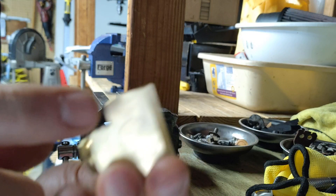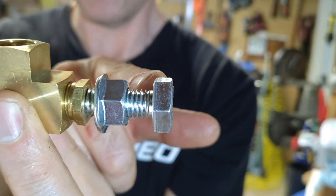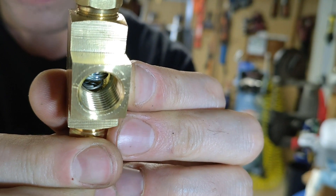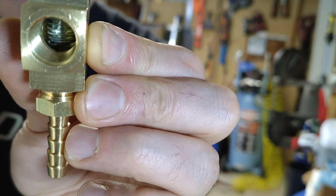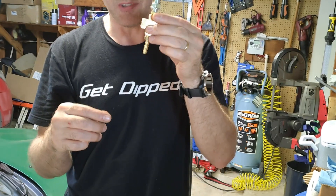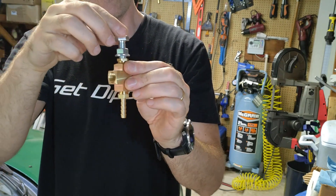That's pretty good. Make sure all the shavings are out — easy to do, just blow it out. So we have our adapter threaded for M10, the M10 bolt installed, and the jam nut loose. I've removed the other hose barb so you can see inside — you can see the top of the spring. I've wound the bolt down so it's just sitting on the spring. If I crank it down it pushes on the spring and provides tension to the ball bearing. It doesn't take much — less than a turn to close it off to what I could push out of my lungs.